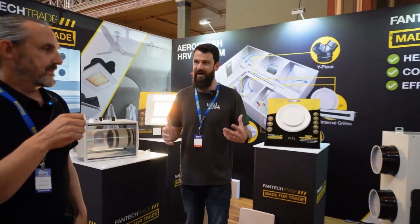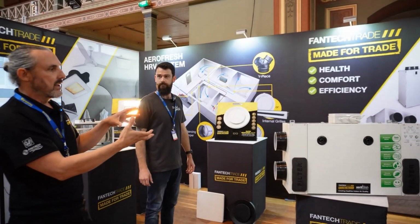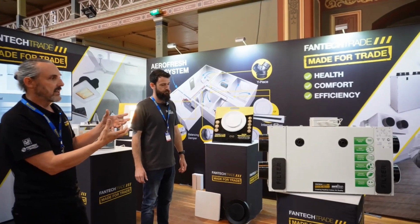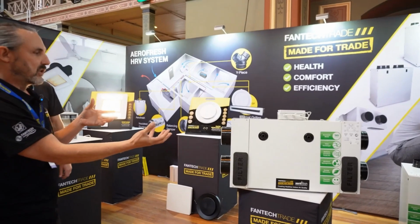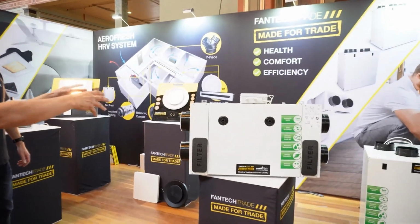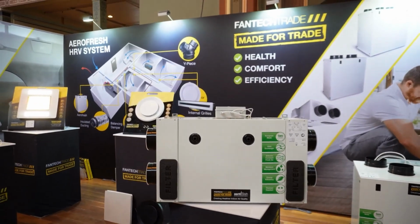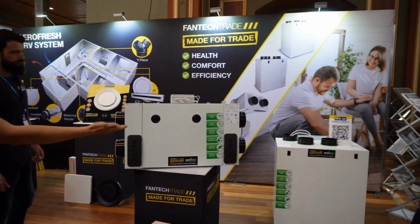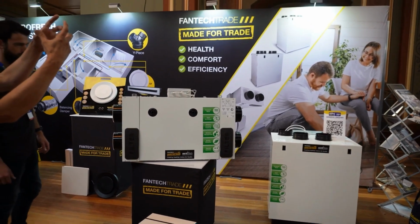We're going to go one up from that. Yeah, so we've got to jump now into a ducted system. So now we're starting to be a little more conscious of duct routing issues and also unit placement. Now we've got two broad types. We've got a horizontal in-ceiling unit, so this unit would actually flip up like that. You'd look above it, you'd have an access hatch. Or we've got the sort of laundry mounted, wall mounted type unit, ductwork coming off the top.